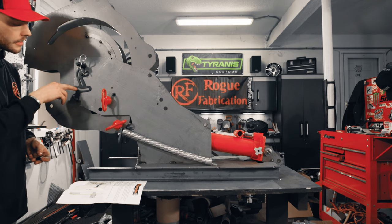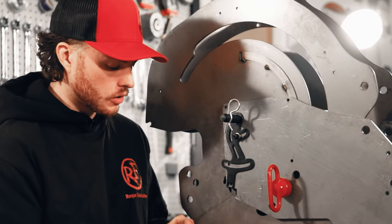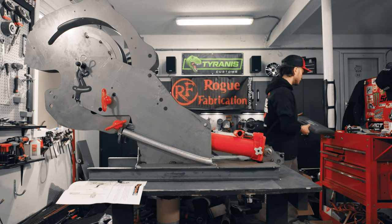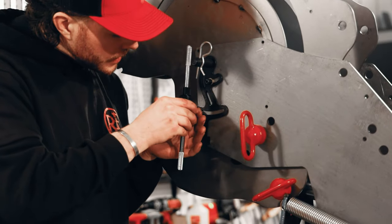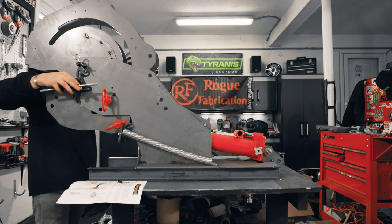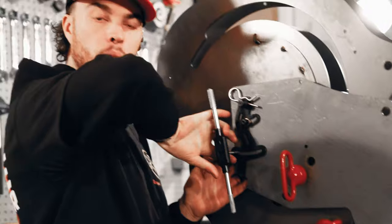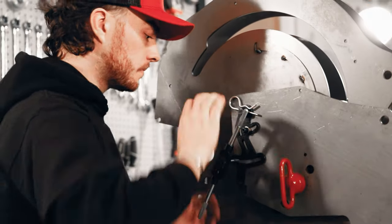And so for this second hole down here, you're gonna need to use a 1/4 inch 28 tap in order to tap the threads into this hole to accept this hardware. Let's take a look if we have one. Take our 1/4 inch 28 tap, feed that right in here, and carefully tap these out. Slide this pin back, give myself some room. Again, this is an upgrade, and so if you're just using the standard degree indicator, you should only need the one hole.